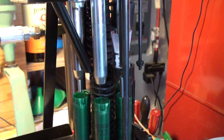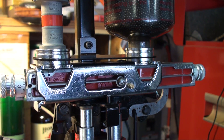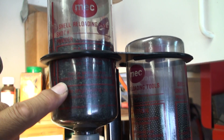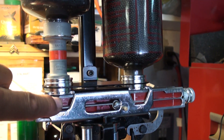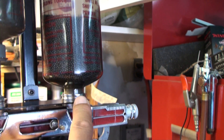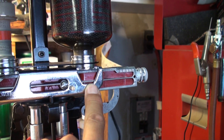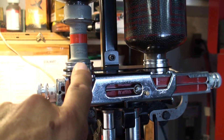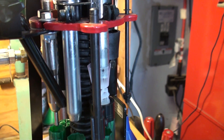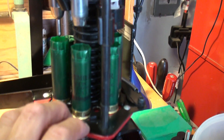At the same time, powder is dropped from the powder tube into the hull. This is predetermined via a standard slide bar — in this case, a universal slide bar or shot bar. In this bottle you've got your powder going into an adjustable pocket. Then you have your shot, which also falls into an adjustable pocket. In this case you're dropping an ounce and an eighth of shot, and approximately 20 grains of powder. The tube forces the hull onto the primer and seats it.